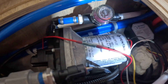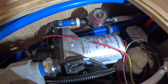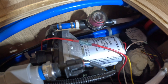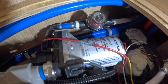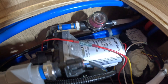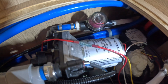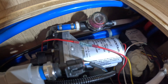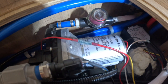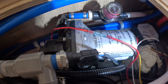You can see the water pump right there. If we just turn it on low, it runs slow, and you increase the speed — it picks up in speed — and you can slow it right back down. That helps so the lights don't flicker in the LED system, because otherwise the light flickering is kind of annoying. So it regulates and smooths out the water flow and the power consumption.